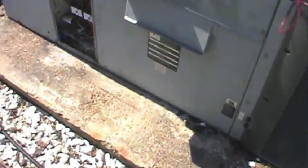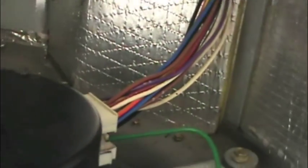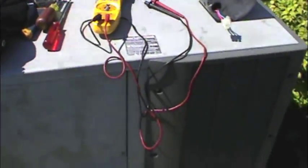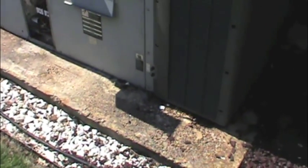I'm going to make this one video for you guys. I have an ECM Zebra kit that I used initially to diagnose it too. All I did with my Zebra was unhook that 16-pin connector and plug the Zebra up to it, and it will run this motor. If the motor won't run, there's something wrong with the motor or the module. With the Zebra kit, I can definitively tell that the board is not the problem — the motor or the module is. From there I looked at what the motor was doing, and it was hunting both with the unit board hooked up and my Zebra hooked up. Because it was hunting, we diagnosed the module as good.